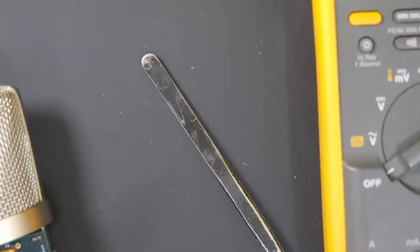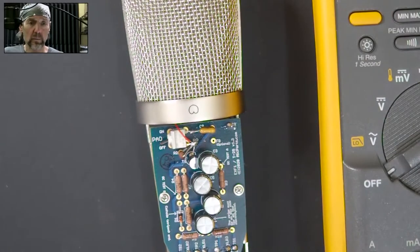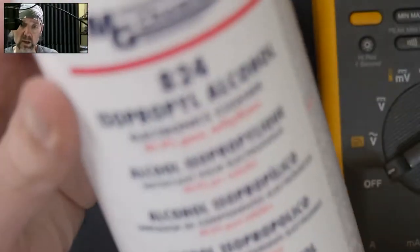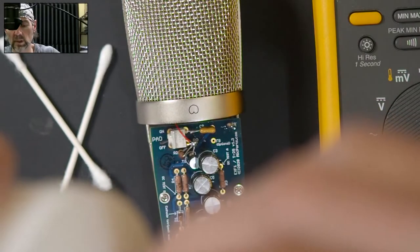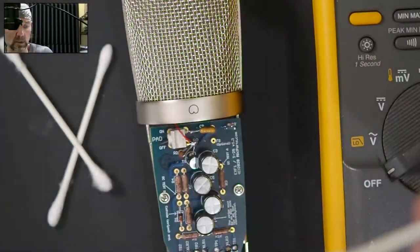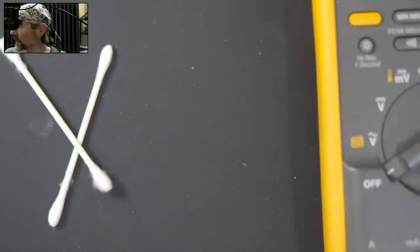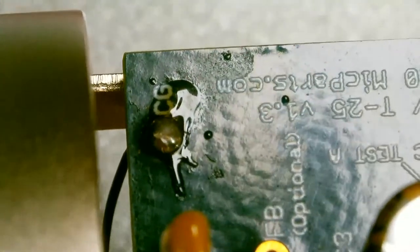So let's do some cleaning. What I like to use are these Q-tips and 99% isopropyl. You don't want to leave this uncapped because it's highly volatile. Here's the CG joint — you can see how it's all gross and smeary, with a big shiny blob of flux from soldering that one wire. So we can make that go away.